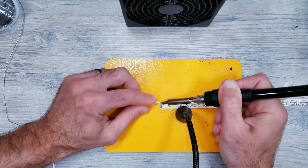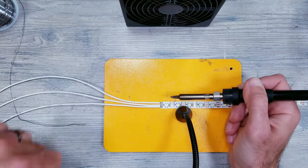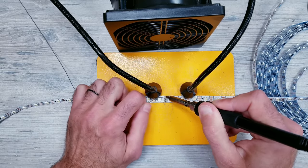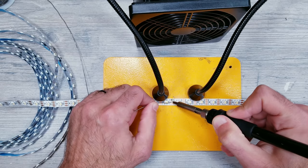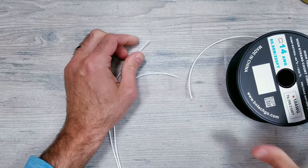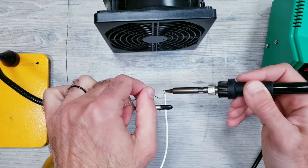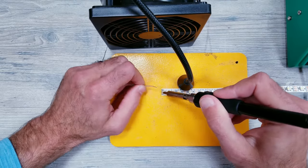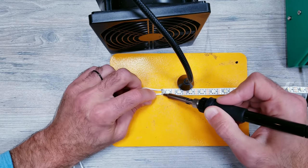Right here I'm attaching my three 8-foot long wires to the beginning of the LED strip. Then I'm connecting the end of the first strip to the beginning of the second, and doing the same for the third section. I'm also connecting some power injection wires to the very end of the LED strip just in case — for this I only need two wires since I don't need the data line. One goes on the voltage pad and the other to the ground, with nothing connected to the middle data pad.